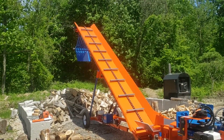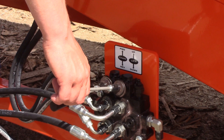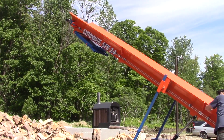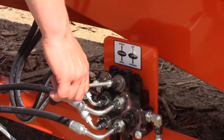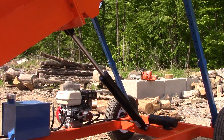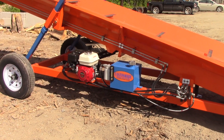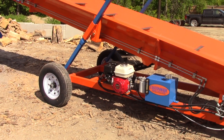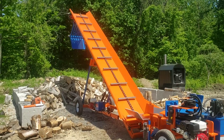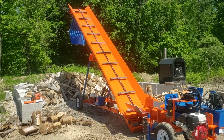They also have a hydraulic lift on them, which is really nice and makes it easy. It's powered both ways, which is a big bonus — a lot of them don't power it down, they just float down. The problem with that is when it's warm out the hydraulic oil will drop fine, but in wintertime when you want to get going in the morning, you'll be waiting on it since the oil is pretty thick. So we hydraulic down just for that reason.